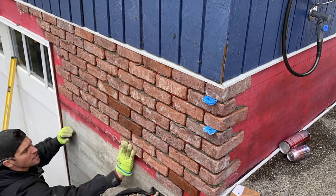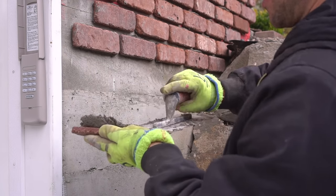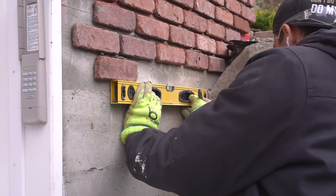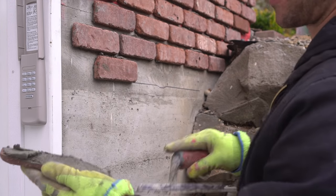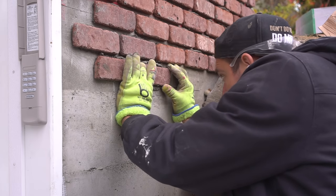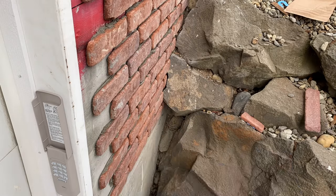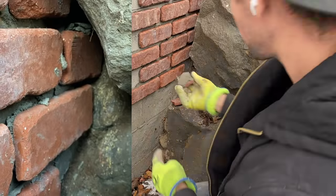You've probably noticed that I'm working from top down rather than bottom up. I really do wish I could work from the bottom up, but given my unique circumstance it was better to work top down because I want a perfect row at the very top since that's going to be the more visible line that catches your eye. As I work my way down the wall, I apply a level line every three or four rows to ensure I have a proper gauge of where true level is.